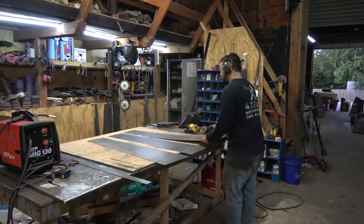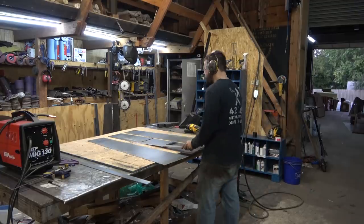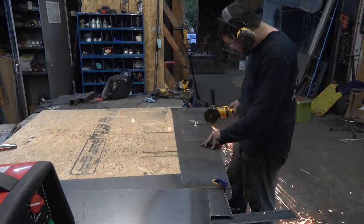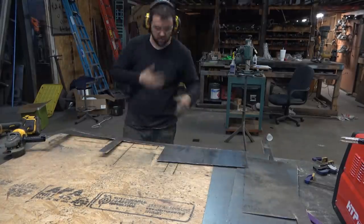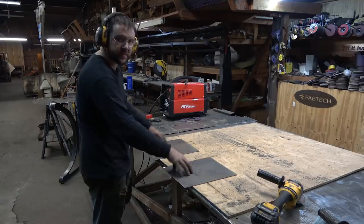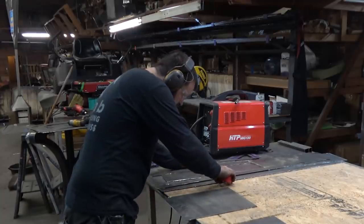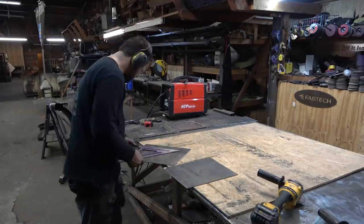So now with your three full wedges and one side piece, find the wedge that most closely matches the size of this one. They're all pretty much the same, which is fortunate. If you get off a little bit, it's okay. We're just going to use this piece and cut along the edges just like we did with the straight edge to make it a duplicate. The last thing we need to do is reduce these two rectangle pieces we saved from earlier to the correct size to fit right here and right here in our side pieces. On the plans, you'll get a measurement — but confirm that measurement with your actual cut pieces, because if you wobbled off your line or used a thicker cut disc, you could run into problems.